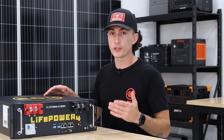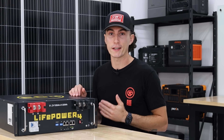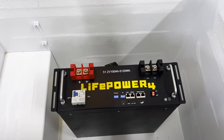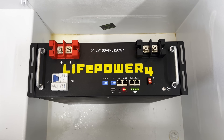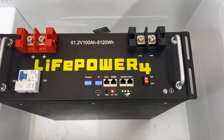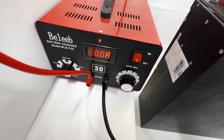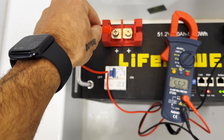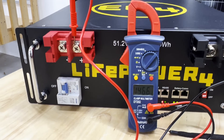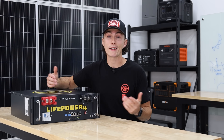This battery is rated to cut off charging at minus 5 degrees Celsius and cut off discharging at minus 20 degrees Celsius. We gave this a real-life test — instead of just dipping sensors in cold water, we threw it in the deep freezer for 24 hours, then fired it up. Immediately when you flip the switch, the alarm light comes on, showing it's protecting itself. We plugged in a charger and it accepted zero amps. We also checked the voltage at the terminals and it was nothing — good job. It will not fry itself trying to work in the cold when it's not supposed to.